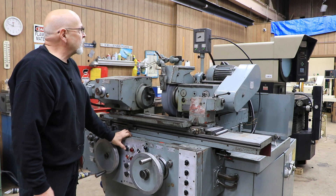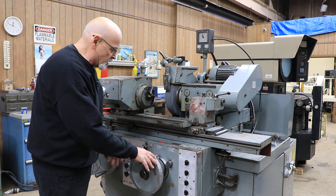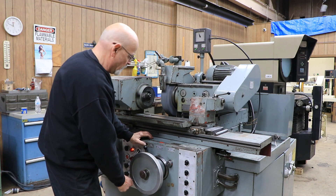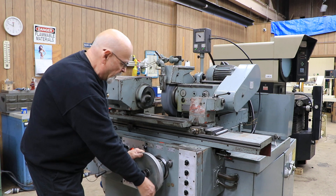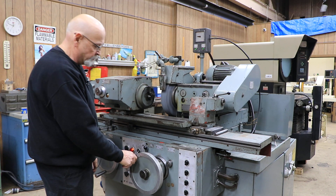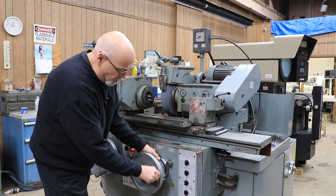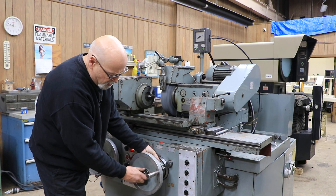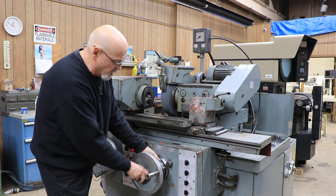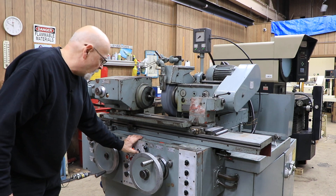What you want to know about using this machine by hand or with the automatic plunge: there is a dead stop here, and clockwise is what brings the slide toward you. If you have the stop on, there's going to come a point where you hit zero and you're up against a solid stop. This whole thing can be rotated by loosening the knob in the center — it's just an eccentric. If you turn it fully around, it's ruined, so bear that in mind.